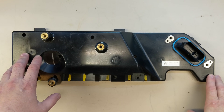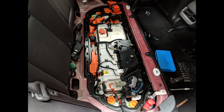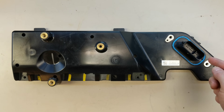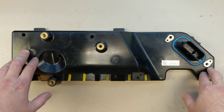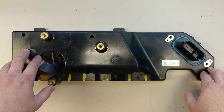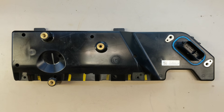This is located in the Model 3 and Y, under the back seat under the cover of what Tesla calls the penthouse. There's a big metal cover and this connector is exposed through that cover and connects to the car. This is the only data connection for the battery pack. It also provides signaling for the charging process, the high voltage interlock loop, which is a safety feature, and the startup voltage, because this thing provides its own internal voltage directly from the battery to operate. The reason it does that is mainly for safety because it needs to fire the pyro fuse in the event of an overcurrent event. If you haven't seen my video on the pyro fuse, I'll provide a link in the description — it would be worthwhile to watch.